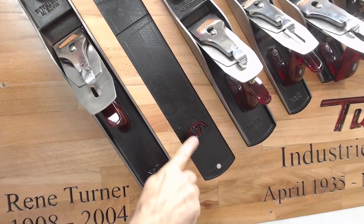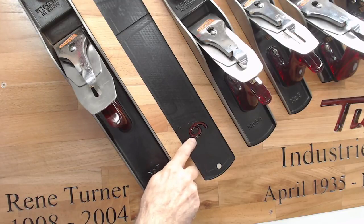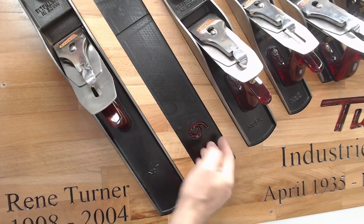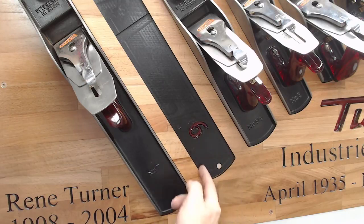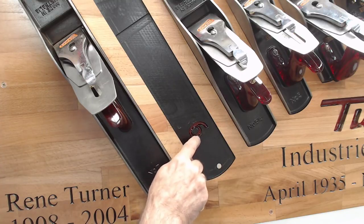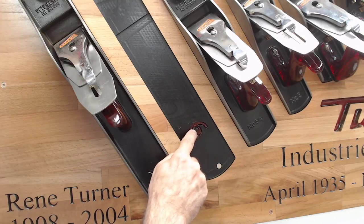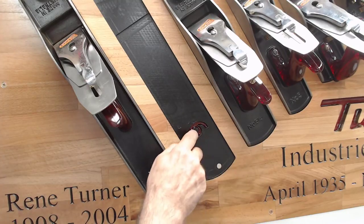Okay, that might work. So here's the six. Now the thing is with the six, it's got this piece in the middle. And so I had to take this down with the CNC and leave 2 millimeters of timber at the back of the board. So this is 18 mil thick. This is 6 mil recessed in, so that leaves me 12 millimeters. So I took this down 9 millimeters, I think it was, from this point, which left this sitting in there. Otherwise, this would have just gone pa-ting across the room. I would have lost it.